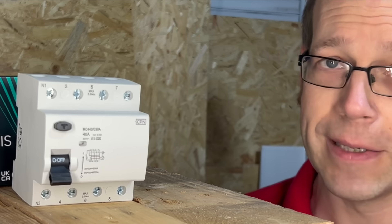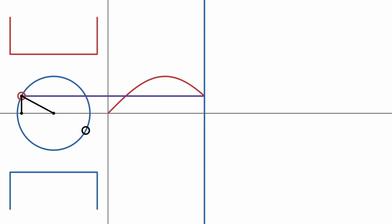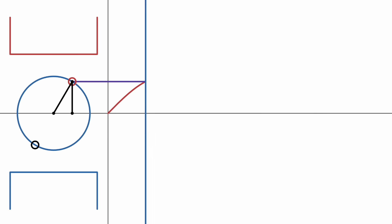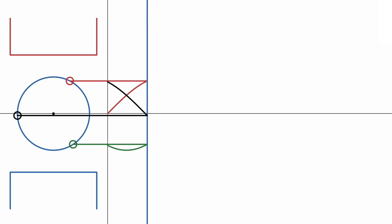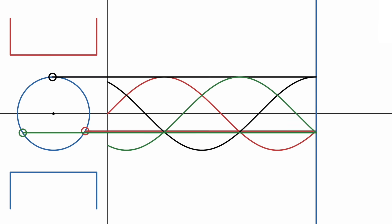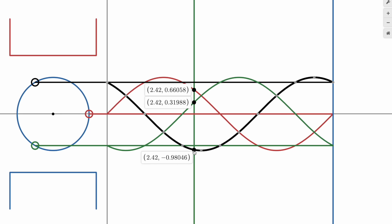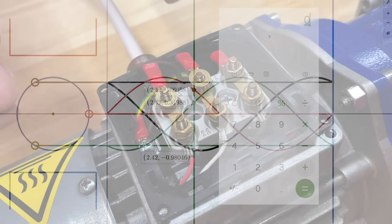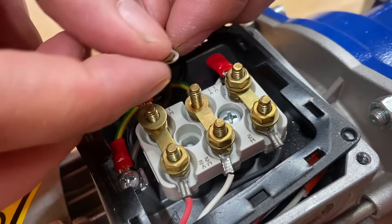It's the exact same principle with a three-phase circuit. If you combine the currents in the phase conductors with the current in the neutral conductor, then you get a total of zero amps when you take into account the direction they're flowing in. Remember, we're dealing with AC electricity here, so the current is repeatedly rising, falling, changing direction, and then rising, falling, and changing back to the original direction. We can represent that process as a waveform. Because the waveform is generated by spinning machinery, we can say that this takes one full rotation of 360 degrees. The conductors in the generating equipment that create the alternating current in the three phases are offset from each other by 120 degrees, which means that a three-phase waveform looks like this. If the current in each of the three waveforms is equal, then we can assess the waveform at any point in its progress and see that the three values of current add up to zero. So because the three currents meet at the neutral connection, they are cancelled out and there's no current in the neutral. That's why most three-phase motors have no neutral conductor — they don't need it because there's no current flowing through the neutral.